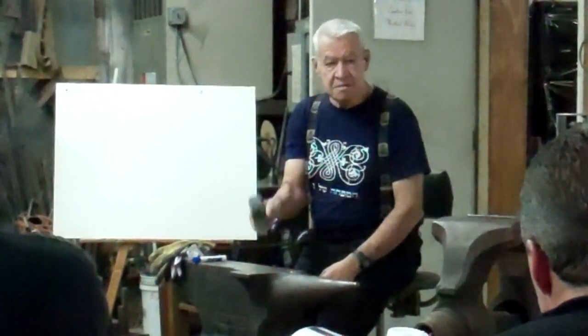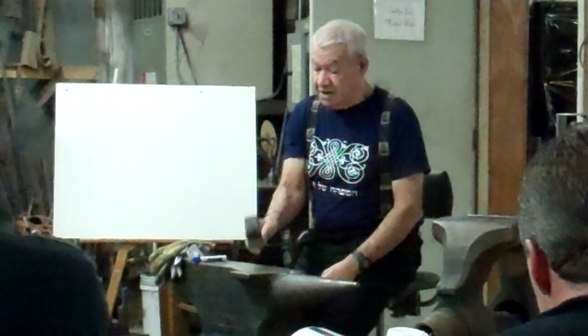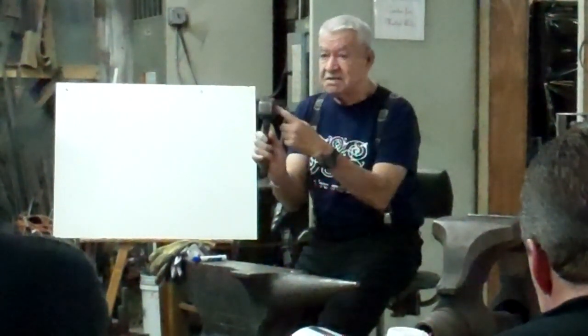So the hammer is jumping a bit. And I'm using this little jump to bring the hammer here. Now, when I bring the hammer here, I'm shortening this distance, and from here to raise the hammer is very easy. So even an old fart like me, sorry for the word, can work hours long without getting tired and without damaging my hand.